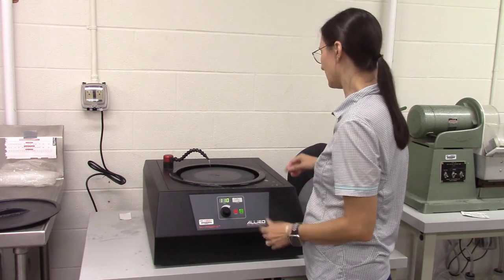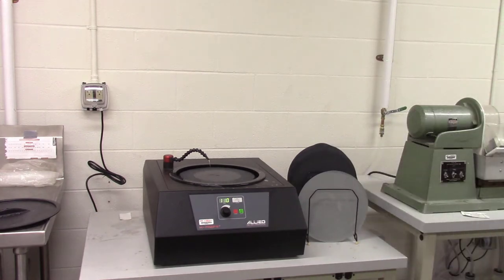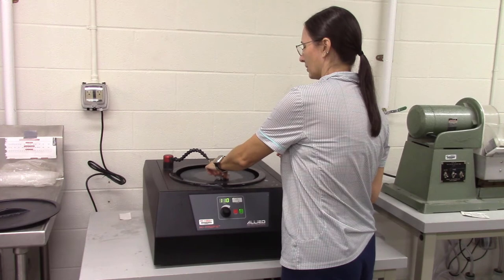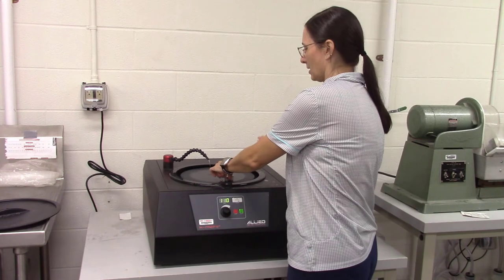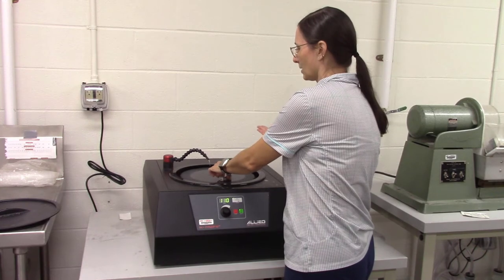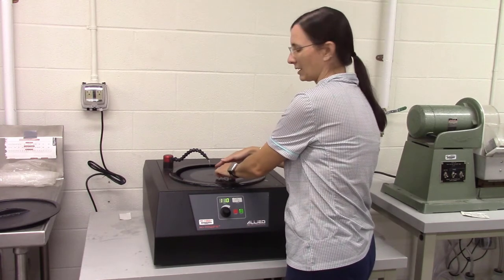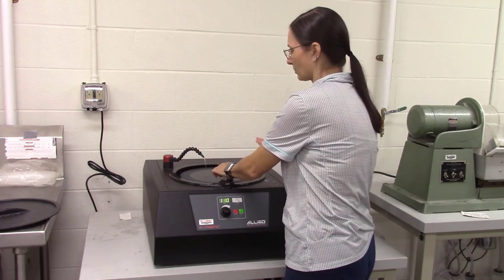With this going, you can put a sample right here. If you have a thin section on one of these little sample jigs, you can hold it, or you can hold a rock sample, and just hold it down onto the surface. Like our other polishing equipment, you don't want to push down on it — it's the sideways motion of the paper that is going to produce the polish. Just hold it so that it's in contact with the paper as it rotates, positioning it in the area where the water is. This has a nice adjustable nozzle, so you can change the location of where the water is being placed.